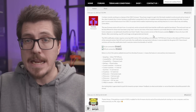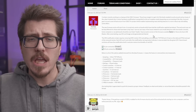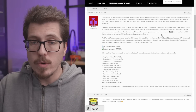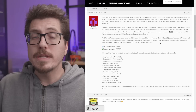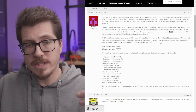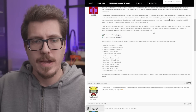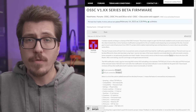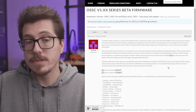Like the NES RGB — the NES has a really hard time being upscaled by the OSSC — but I have a feeling they're talking about arcade boards and things with really strange sync. They say that many issues related to sync and mode detection with more exotic consoles, home computers, or arcade boards should now be fixed or fixable. The only downside is that this new beta firmware only works if your OSSC has a hardware modification — you'll have to solder on an SMD resistor, and you might lose the ability to use the red LED. So if you still use an OSSC and you're comfortable with modding it, maybe you should try out this beta firmware.